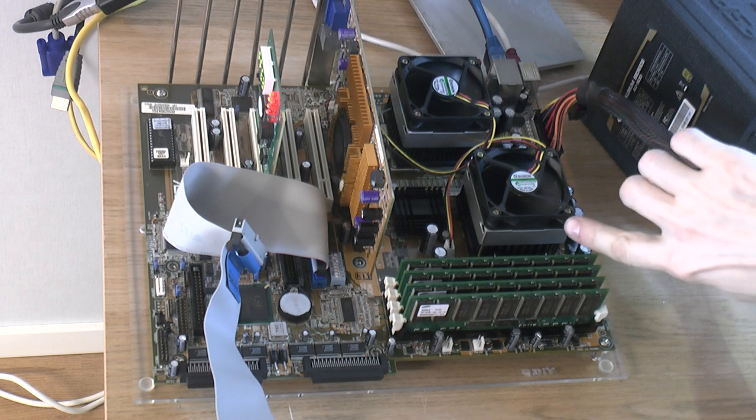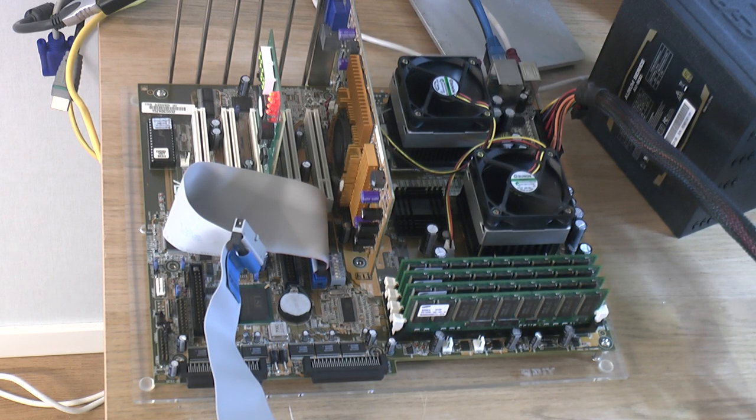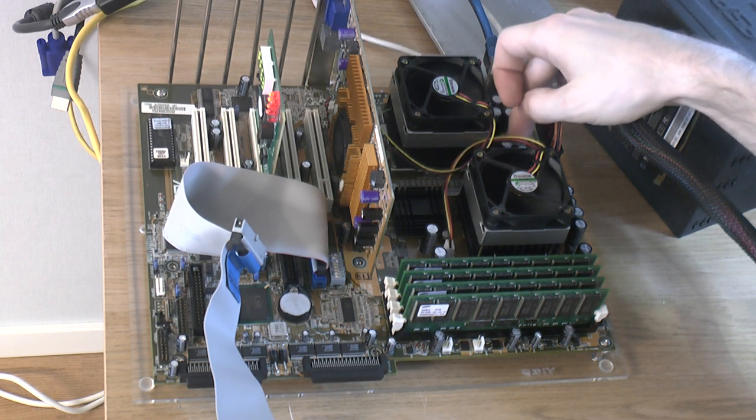And because these fans are thicker than the other ones, they actually move more air for the same RPM. At a lower RPM they move a little bit less air, I think, than the other ones, but not that much because of the extra thickness. You get more fan blade area and better static pressure. And the hub in the middle is a lot smaller. So that's also nice. So I think we can make the system even quieter if we want to.